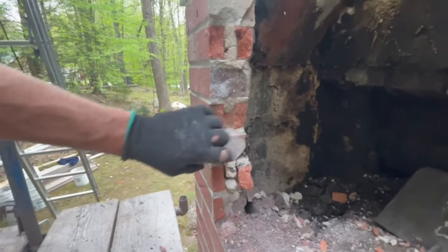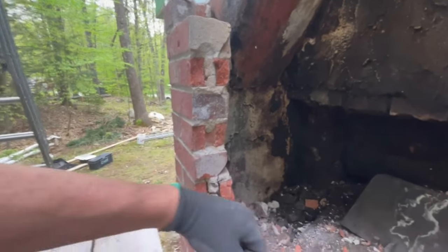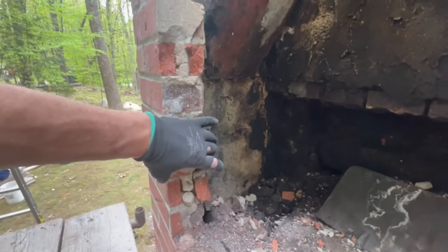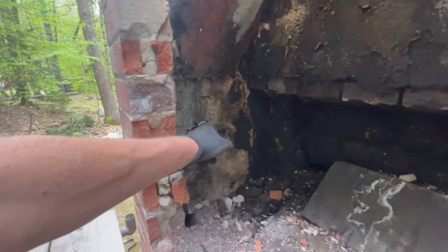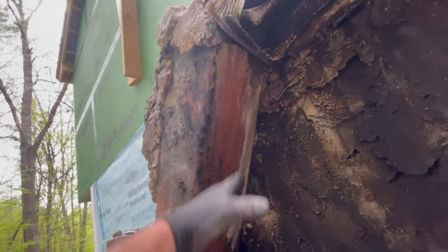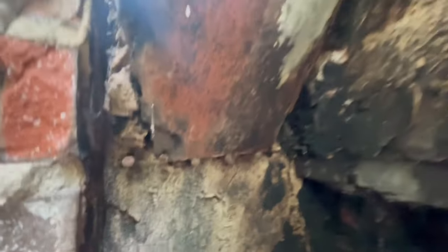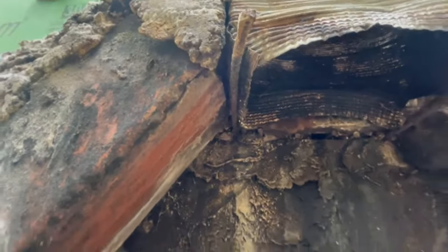What you have here is just the back wall of the chimney is the interior wall of the smoke chamber, so basically you're only four inches thick here. This is just a chopped-up piece of flue that they used to bridge this to create this angle, and you can see they just propped that up on some nails and had some rebar here to help hold it.